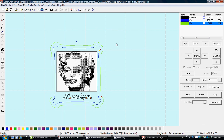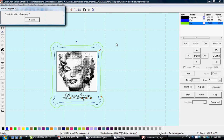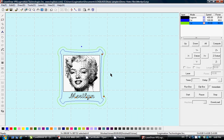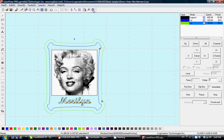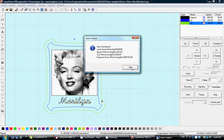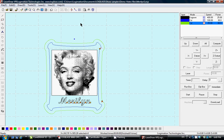You can simulate the job using the simulation shortcut. You can see how the engraving will go after transferring the file to the laser machine — all engraving parts are shown in red. You can also get a working time estimate by clicking the clock icon — it shows approximately nine minutes, accurate to plus or minus 10–15%.